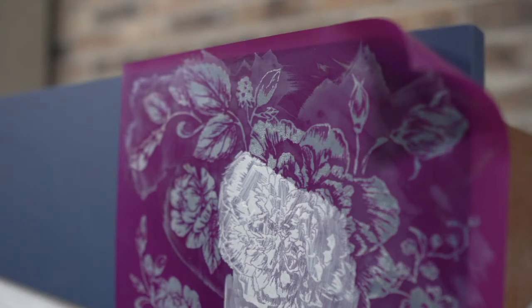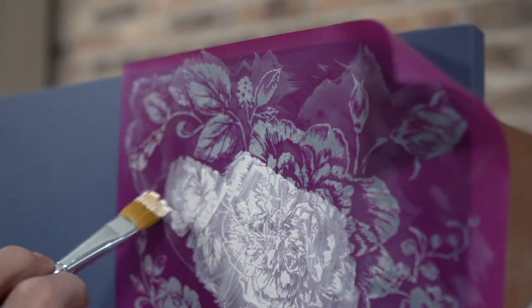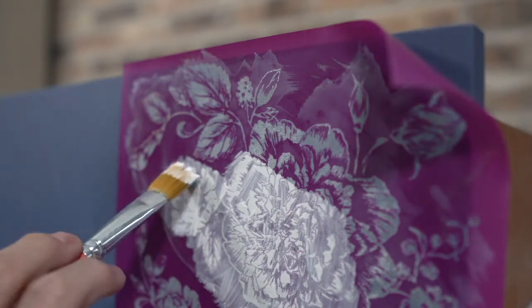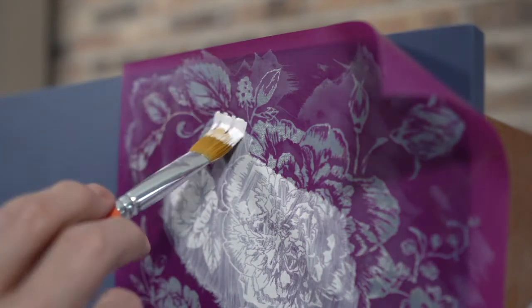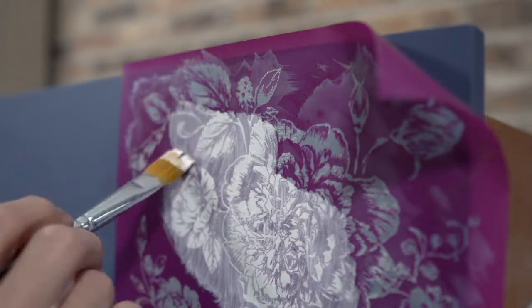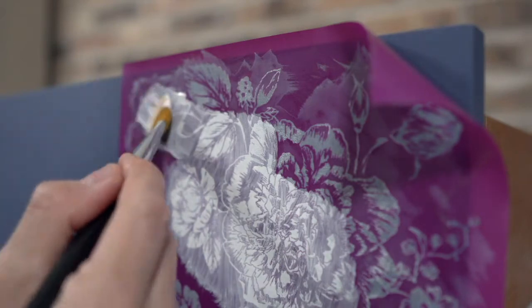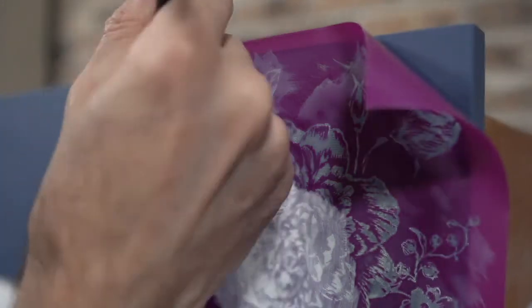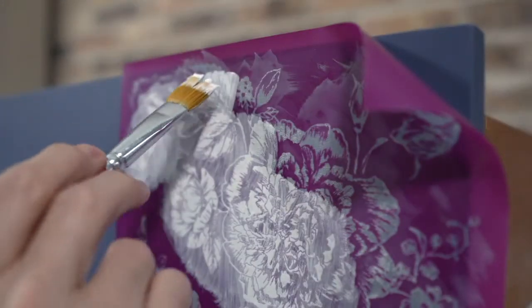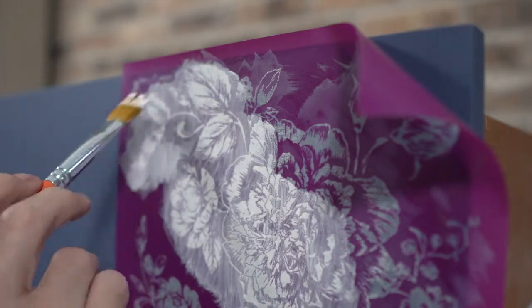Really, in my opinion, you can use anything that's thin enough to spread. And since I had just used whitewash, I thought I'd give it a try. I told my viewers last night that, hey, if it doesn't work out, I'll just lightly sand the drawer front and repaint it. And I literally did my live last night and I forgot about it, and this morning when I saw it, I'm like, oh, that looks great. So it's really vibrant, very white, and it looks good. And keep in mind that whitewash is a glaze, so it has some top coat in it, so it almost protects itself. It's kind of cool. All right, do you see that so far? Just brushing it in there. I'm not brushing a lot.